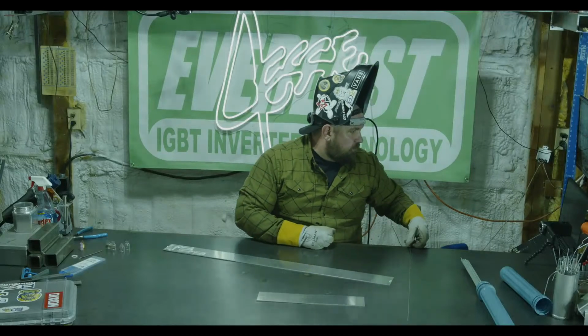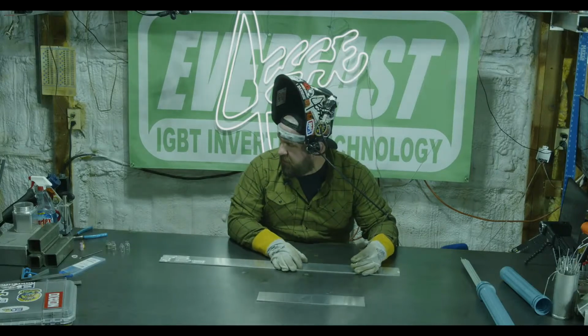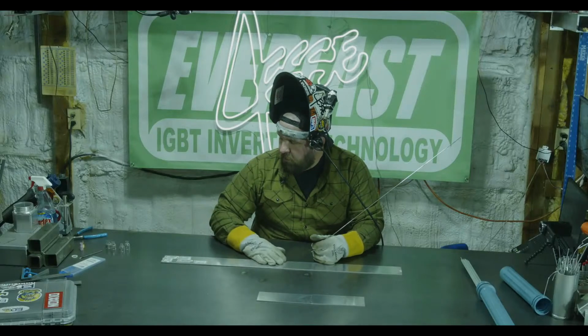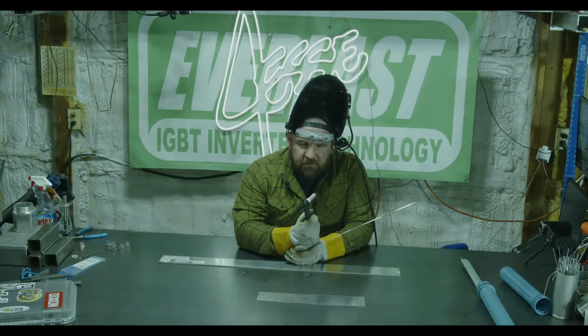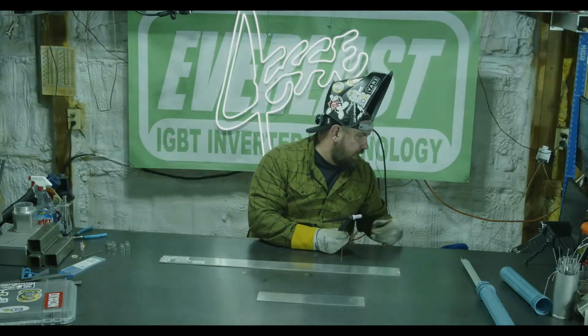Yeah, Richard, I used to run a number 8 gas lens. I've switched back to a number 7. I run 1/8 inch tungsten, which we'll get to in just a second. Like I said, we'll run this number 6 cup down at like 5 CFH just to show you guys what too low a gas flow looks like. And then we'll move on to what I prefer, which is the gas lenses. Let me get this hood down so you guys aren't staring at my ceiling.